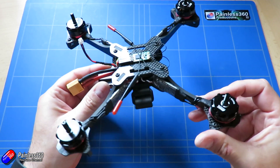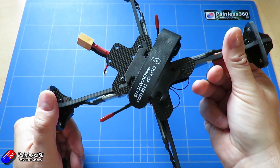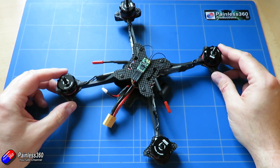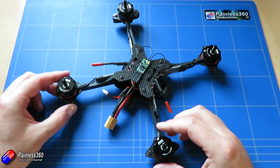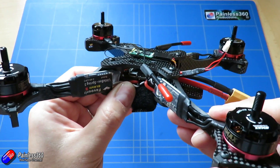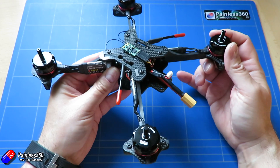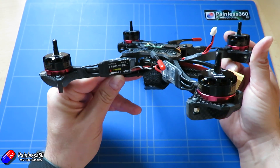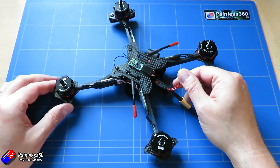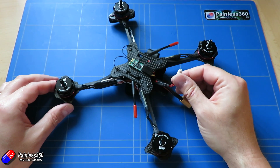So this is where we've got to in this video. We now have the receiver connected, all the pins in place, and this little guy is pretty much configured and ready for the final setup in Betaflight and our test hover in the next video. Join me in the next video where we'll do the final checks: calibrate the accelerometer, check the motors are running okay, check the receiver, and have a play with BLHeli — we'll certainly need to reverse one or more motors. If there's time, we'll also look at adding the BLHeli-S firmware onto the speed controllers. Then at the end of the next video we'll go for a test hover, and in the final video we'll add the Connex bits and pieces on top, ready for high-definition FPV.